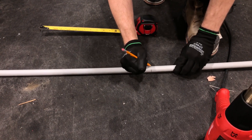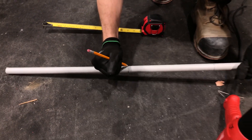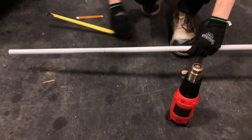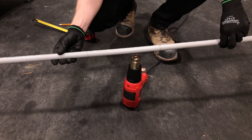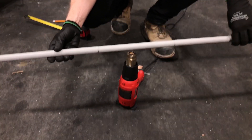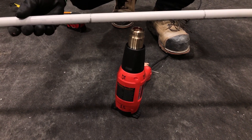You're going to mark 10 inches apart on your pipe, and that's going to be where your 90 is going to take place. Both those lines on the outside, you're going to circle it all the way around the pipe, and that's going to be where the back of your 90 is on each side, and the middle is going to be roughly the center of your 90.